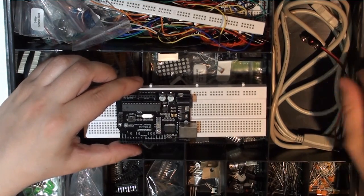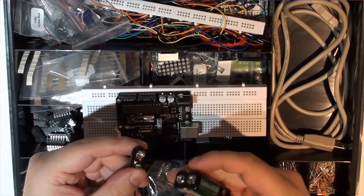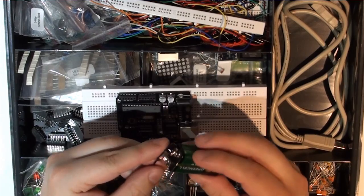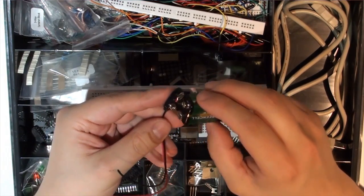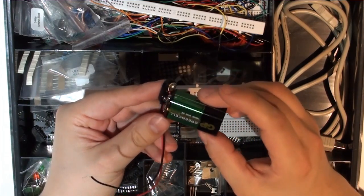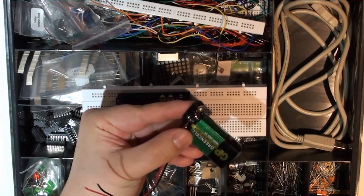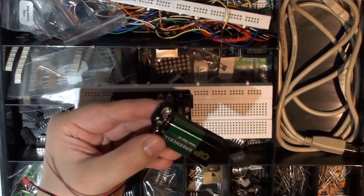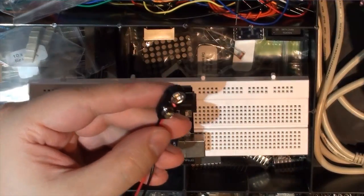There's also a cap and a 9V battery. Just take care not to short the leads. That can connect in to use our connectors and circuitry. This is a 9V battery, but most of the circuitry is running at 5V, so you need to make sure that you look at the video on how to use a voltage regulator. Otherwise you'll damage the ICs in the kit.